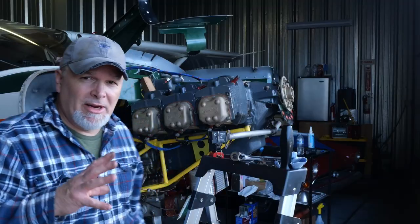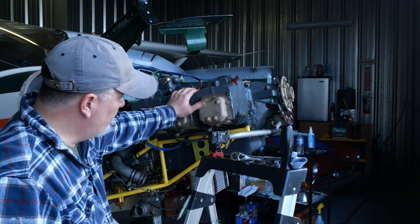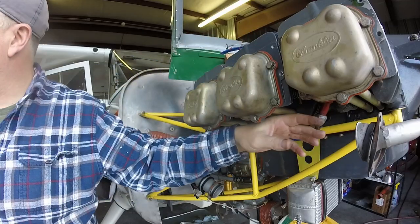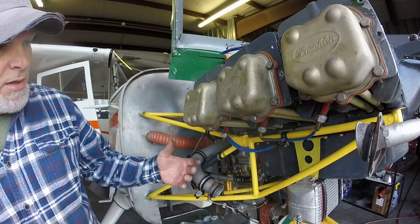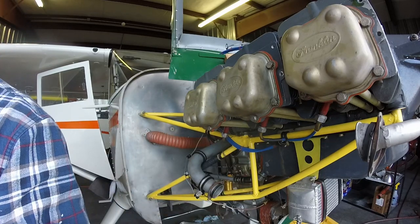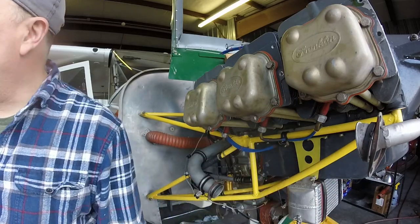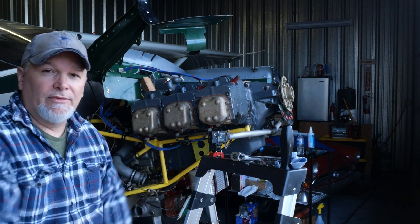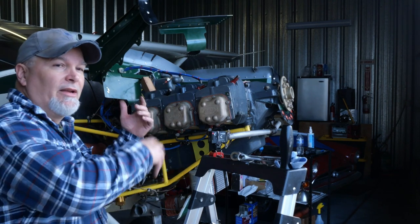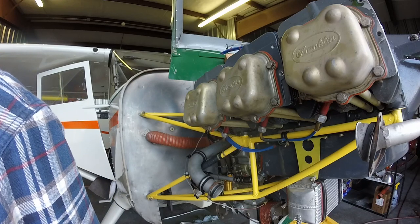All right, so we've touched on just about everything that we need to get the cylinder installed on the airplane. What's left is just connecting all of the spark plugs and the ignition harnesses. It's pretty self-explanatory going forward as far as putting on the intake manifold and then connecting the muffler, putting the baffling back in place, and then I'm going to throw the prop on the front and then do a ground run before taking the prop back off so that I can put the cowling on. For the interest of saving some time, I am going to just leave all that to your imagination.